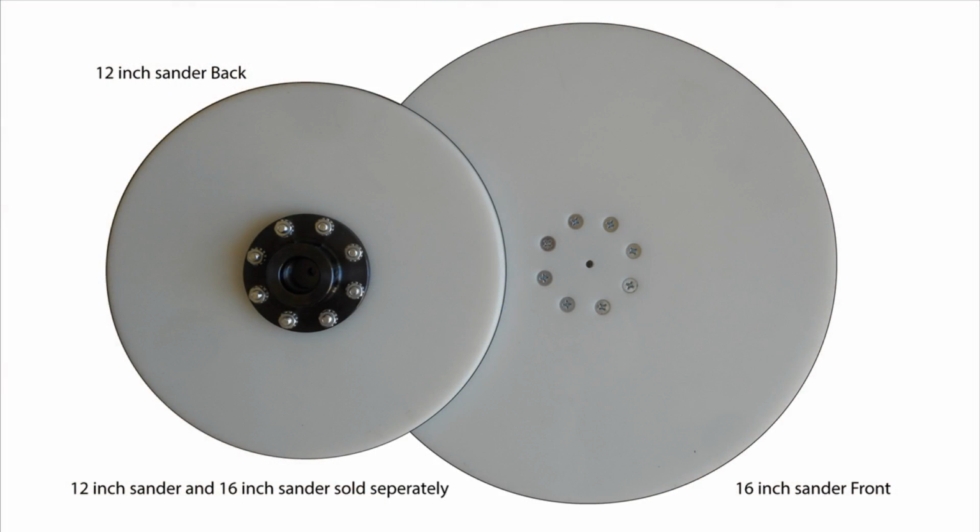We use one of our heavy-duty faceplates so it'll thread directly onto your lathe spindle. HDPE won't delaminate or warp like plywood. It won't dissolve like MDF due to moisture or humidity. HDPE isn't susceptible to moisture or heat under normal use. You need to store it flat on its face and it will never warp.